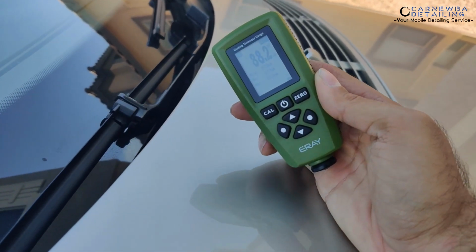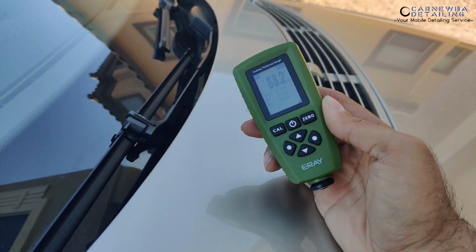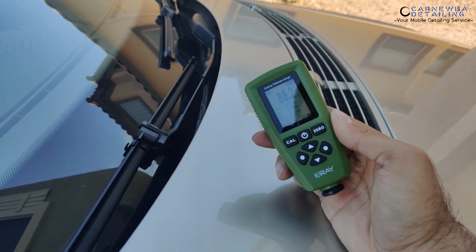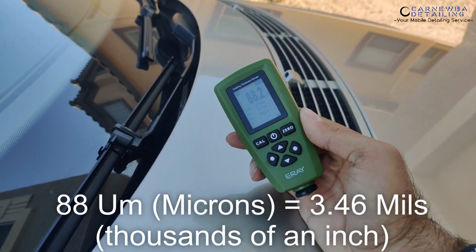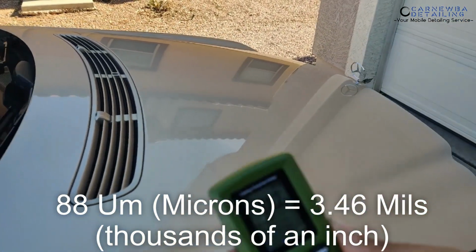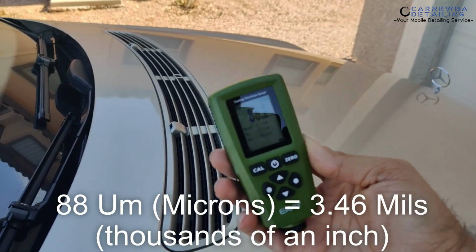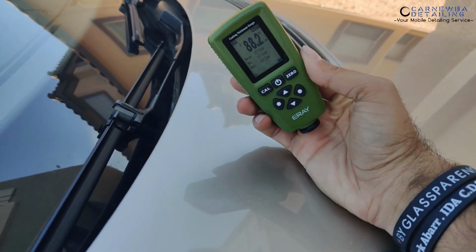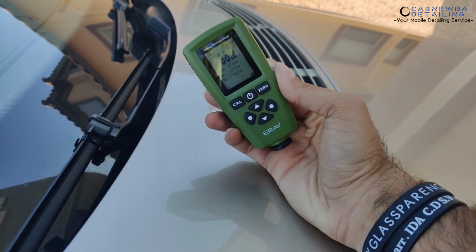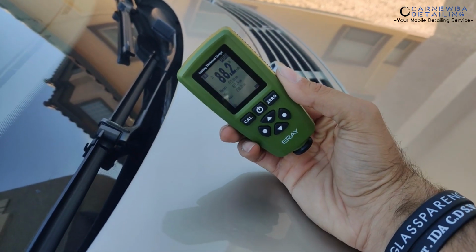Now, microns is a very, very small measurement, so any difference between like 1 to 0.5 is completely fine, guys. You're going to go ahead and grab an average of a panel, and then go ahead on Google, look up a conversion chart. I'll leave links in the description below, and convert microns to mils just to make it easier on you and your customer as well, because this is a very, very small measurement.